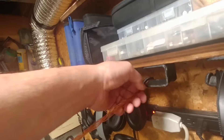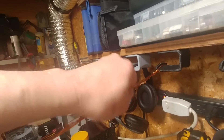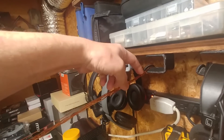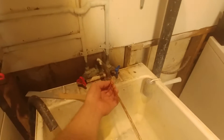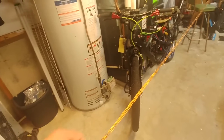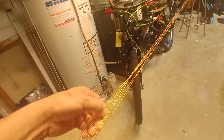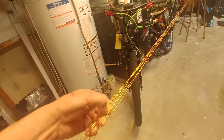I twist them together after I roll them nice and tight, and then I'll cut it right here and that'll stay rolled up as I roll it up on my spool to get it ready to wind the motor. Same thing with here - I'll cut it here, going back and forth trying to get all that debris off the wire, make sure there's no kinks or anything like that, but it's looking good.